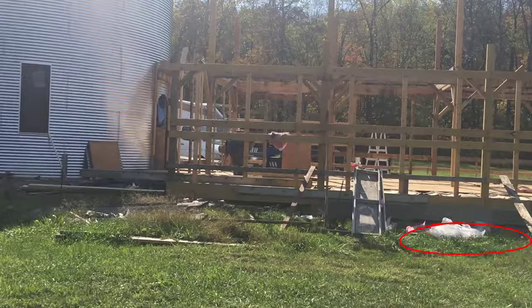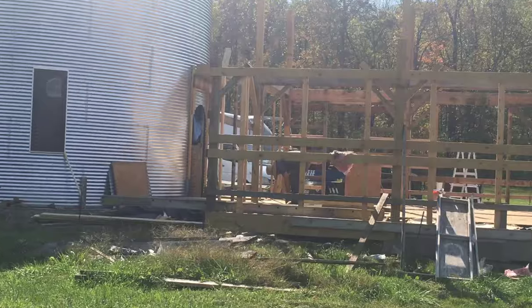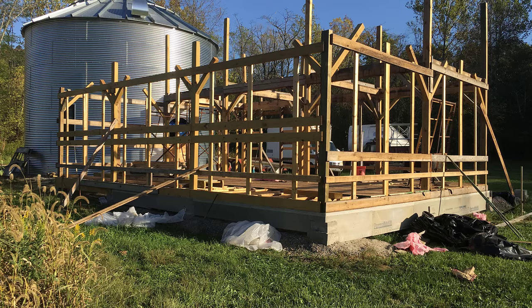Back outside, you can see the foundation boards have been attached. You can use insulation panels — foundation insulation panels — to do this, or you can use concrete board. He uses concrete board; it can touch the earth, it can be put in the dirt, and it will not mildew. So make sure you have something that's approved for being on the foundation.